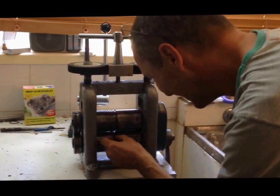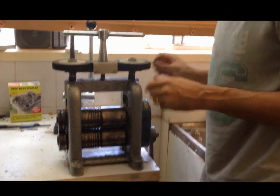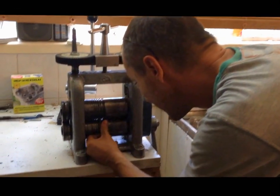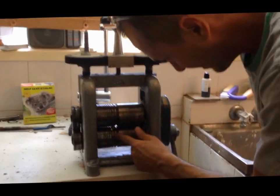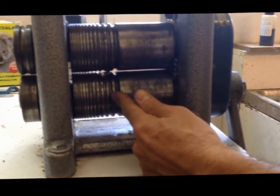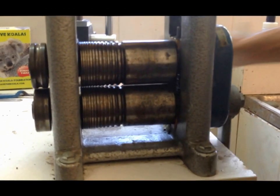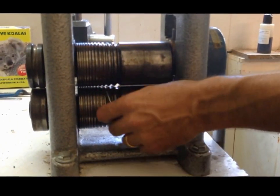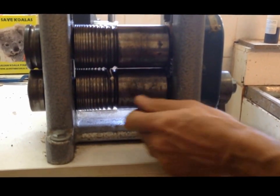With precious metals you don't work with them hot like you do with steels — you always work with them cold. I use a technique with twisted wire where I actually heat it up, but that's not always done. Now it's gone down to the second square — you've moved down a row. Once the plates are touching, that's as far as you can go for each one.